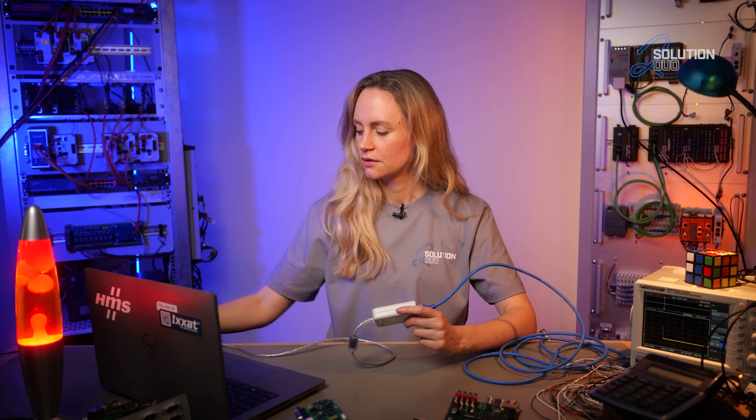Well, another reason is the length of your USB extension cable or the number of USB plugs. If your cable is too long or you're using several USB plugs, the device doesn't work properly. Try the USB to CAN without an extension cable, only one USB plug, and then try it with another PC. This should work.